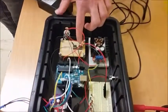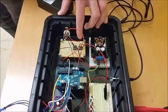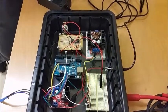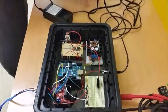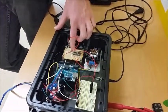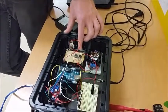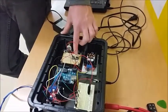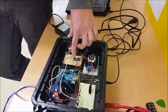This is a Texas Instruments TL082 dual JFET op-amp. This particular circuit is called a Sallen-Key, which is a second-order low-pass filter that also gives us a little bit of gain. We needed that gain because our frequency-to-voltage chip had a minimum voltage requirement — without the gain, the signal from the guitar would not be high enough for it to output anything. So we set the gain to about 1.8, which was just enough.